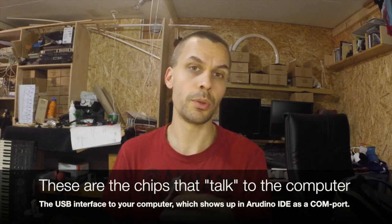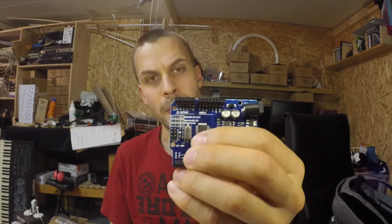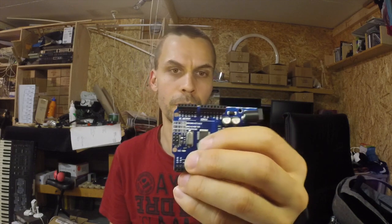I thought I would buy a couple of those cheap ones on eBay. If you read really carefully in the strange Chinese-translated-to-English description, you will see that the ATmega 16U2 has been replaced with a CH340. That's the really cheap one — this one is three and a half dollars. The ATmega 328 is also a surface-mounted IC instead of the normal DIP socket version.